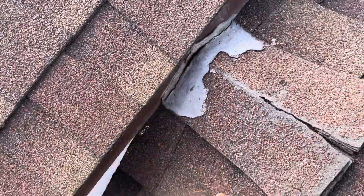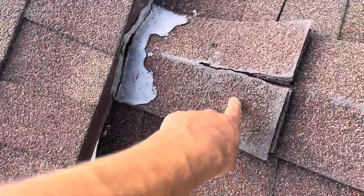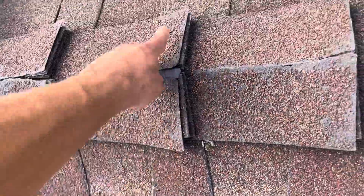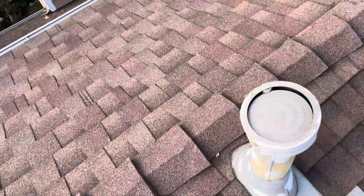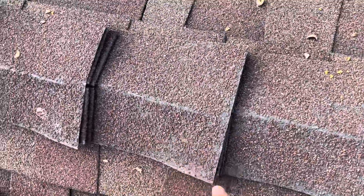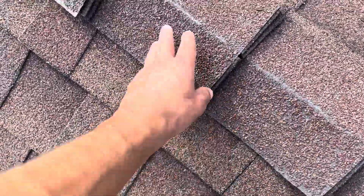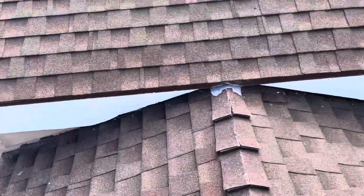Water is definitely getting through on this corner. You can see this is definitely a leak point because there's mastic on there. These ridge caps are cracked as well, just like the first roof plane. Again, we see multiple exposed nail heads on just about almost every single one of these ridge caps. This ridge cap on the end is completely gone — that got eroded and blown off. And you can see just the amount of granule loss on a lot of these shingles — this happens over time when those oils begin to evaporate under the sun for years and years.